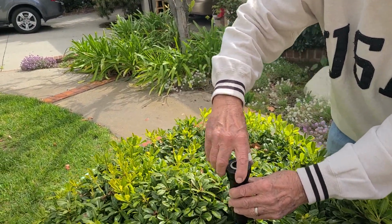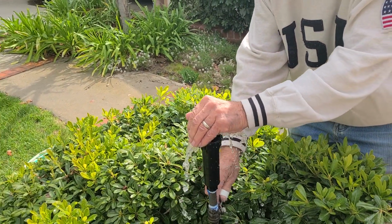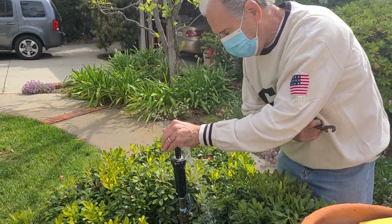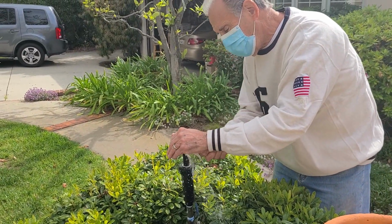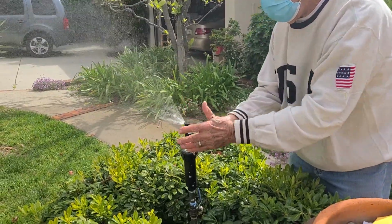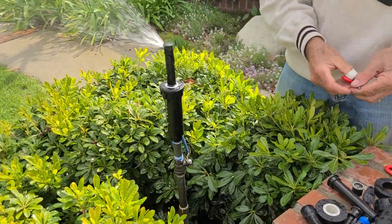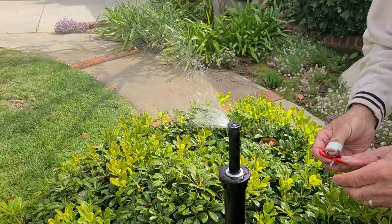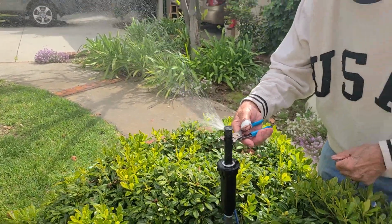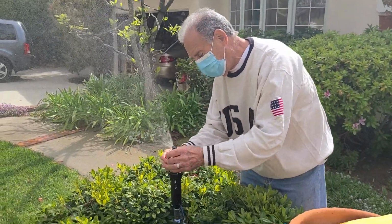So I talked with Ted, and we're going to retrofit all the stems out of the existing pop-up heads to his Valvet Systems in-stem flow technology stem, the little valve stem. He basically has retrofitted that stem and put in a new stem with the little valve replacement. We make them in 4-inch, 6-inch, and 12-inch. 4s, 6s, and 12s. Okay. And they have the little valve in it.